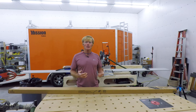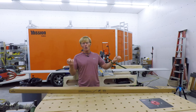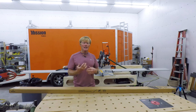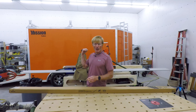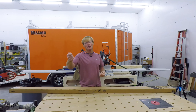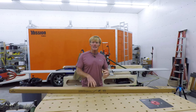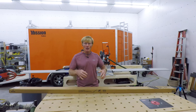The other option is to put up fluorescent fixtures with the ballast, and then you can buy tubes that will work with the existing ballast. But I don't want the ballast. I've had them in the past, and if you get into GFIs — sometimes double GFIs — because OSHA requires that I wire the trailer with an integral GFI, and sometimes on the job I have to plug into a GFI, you can get complications. I ended up with grounding issues in the past. So I decided if I'm getting rid of the ballast, I'm just going to take them out to begin with.